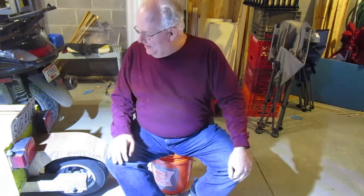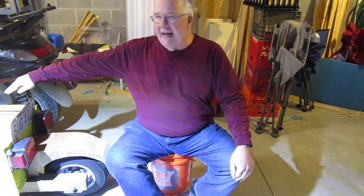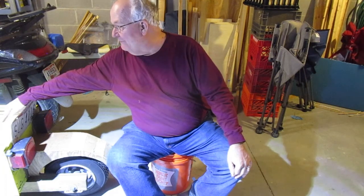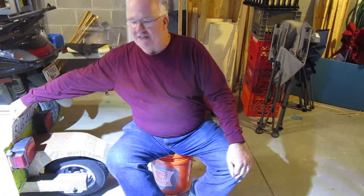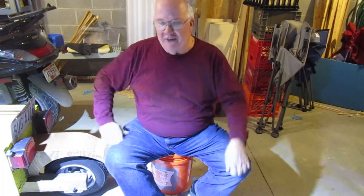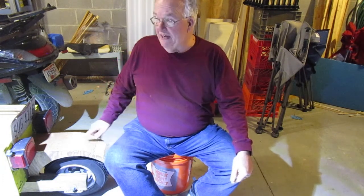I had the wheel up toward the center, underneath, first. Then I moved it back about a foot, still inside underneath the trailer. And I still didn't get the stability I wanted, so I finally just set it all the way back behind the trailer, and it certainly is stable. I have no difficulties at speed, no difficulty in weaving. Wherever the scooter goes, it goes.